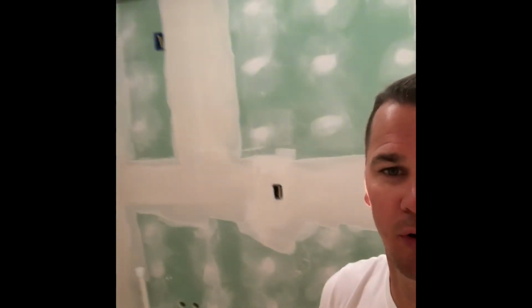Hey, it's me, I'm back. Down here working in the basement bathroom. Quick update on the video, part 4. I am working on my 4th and final coat of drywall mud. I'm using that Proform that I showed you earlier in the video. And you can get away with 3 coats. I'm gonna do 4 coats and then go back and sand everything and circle all the imperfections, and then just kind of go back and touch those up.